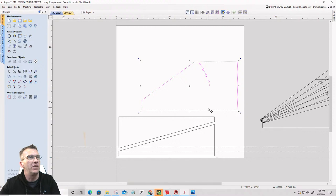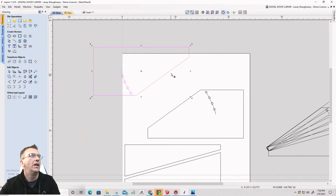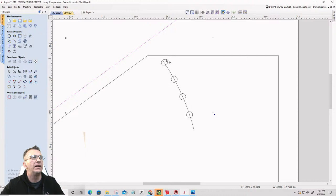So we need two of these — the two sides. I'll take and hold down the control key, drag a copy of this out, hit the letter H for horizontal and the letter V for vertical. Then I can bring this part in here, kind of nest it, so I can get these four parts cut out of this board. This board is 24 inches by 24 inches and it's going to be three-quarters of an inch thick.